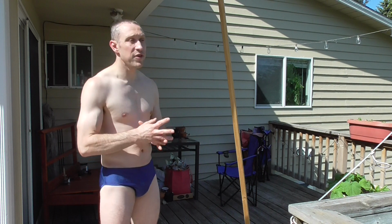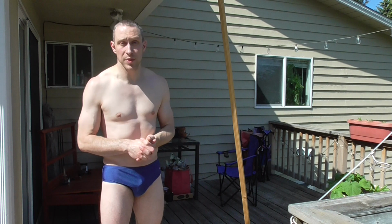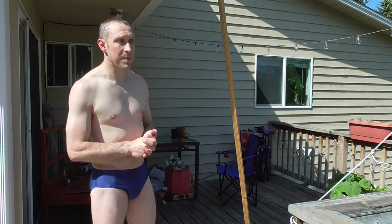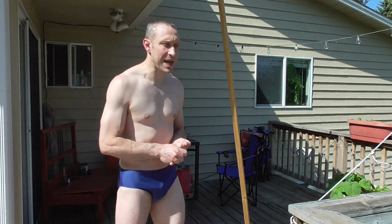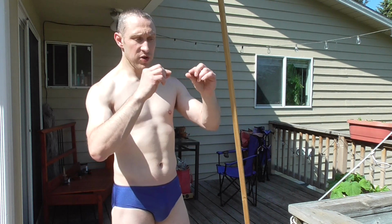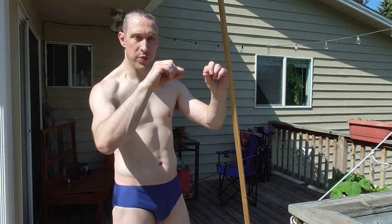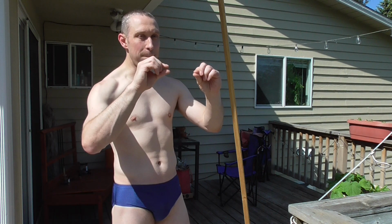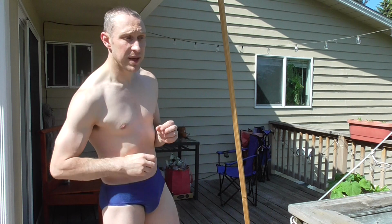As far as the screws go, if you guys are going into a ceiling joist stud, if it's a 2x4, you probably want a screw that's 3 inches long, right? If you can fit one in, you want to go with a thicker bolt, and you will want to pre-drill that so that it doesn't get stripped out, or you don't split the wood, which is a concern. So pre-drill your holes if you can, but in case you've never done it before, whatever drill bit you're using, if you're covering the screw with it, you want to be able to see all the threads, the whole body of the threads, and maybe barely the column in the middle, right? Looking through that screw, or through that drill.